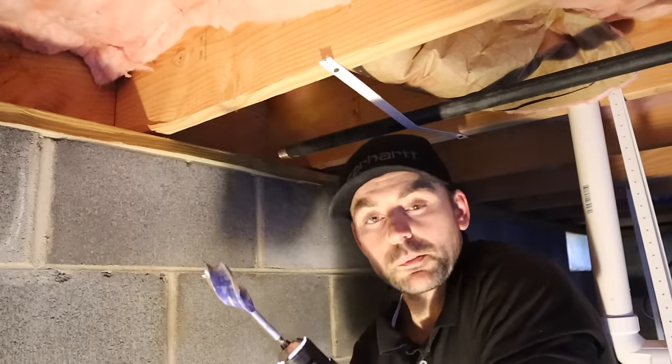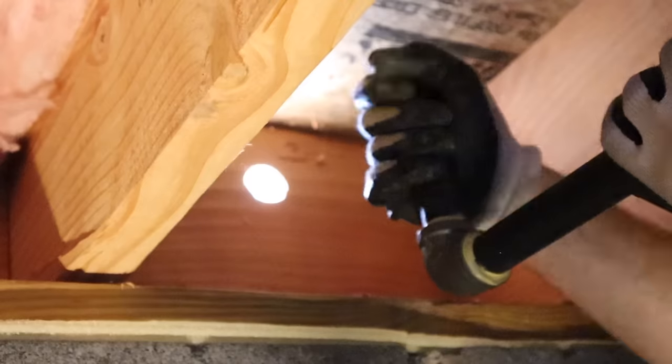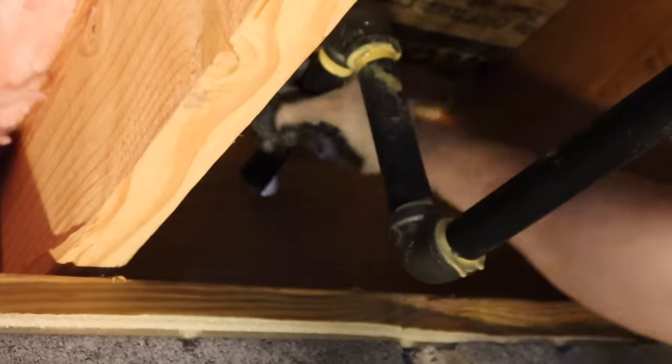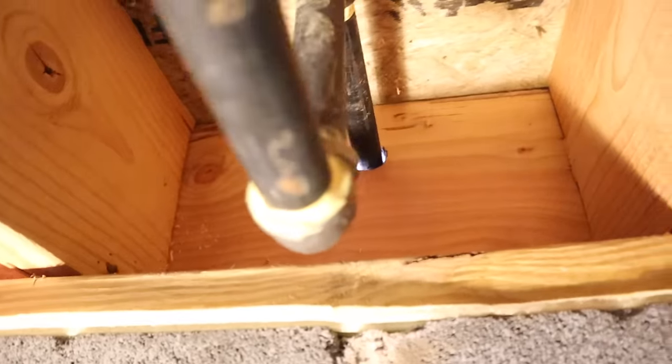I use an inch-and-a-quarter drill bit to drill out through the house — that should be plenty big enough to get the pipe through. I've had to drill through block before, in which case I would have used a rotary hammer drill. The elbow was easy to install: I just put the nipple onto the elbow and used the nipple to turn and tighten the elbow. It was a little challenging to tighten this elbow inside the joist space — I just had to go little quarter turns at a time. That gives a nice run to the outside.